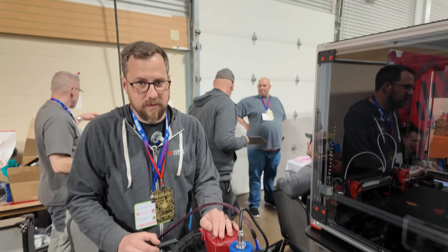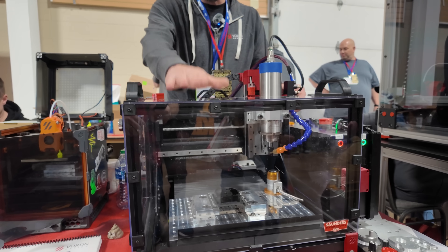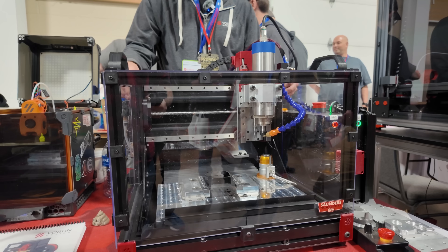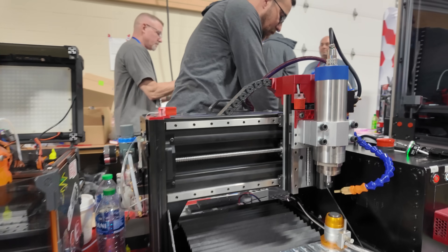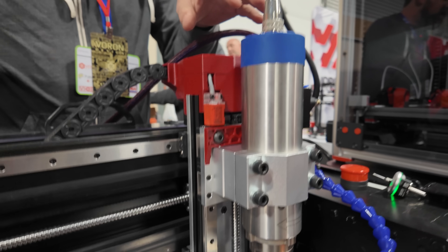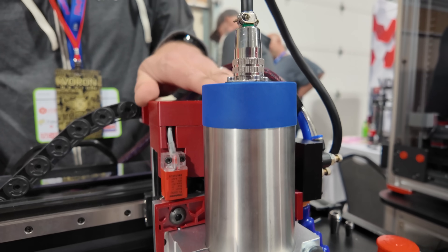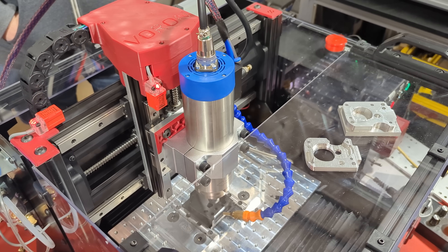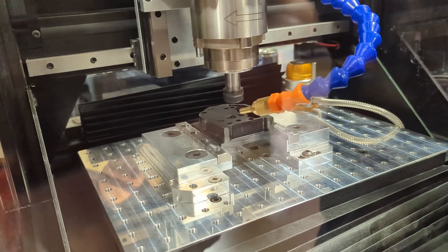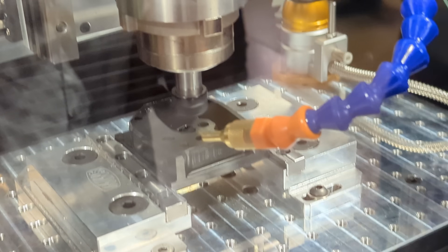Like most Vorons, it's designed to be enclosed from the start. These are polycarbonate panels, because there are spinning things happening inside and we would like to contain them. The spindle is a 110 volt, 1.5 kilowatt, 24,000 RPM unit. Typical tooling is either one-eighth inch or one-quarter inch diameter — a lot of the test cutting has been done with a one-eighth inch single flute carbide end mill.